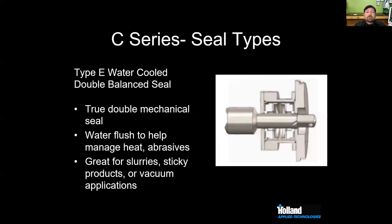And then with the Type E pump, a lot of times we're moving around boiling fluids, and these seal faces get very, very hot. The carbon seals can almost actually melt. And if we're not dissipating that heat effectively, we're going to hear your pump squealing. James, how do you know if your pump seal is getting too warm? Oh, she squeals. You'll hear it across a brewery. It's a loud shrieking noise that makes you want to just smash the pump. It's unmistakable.